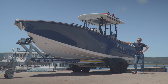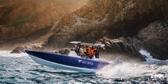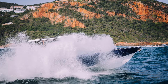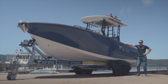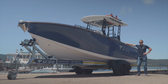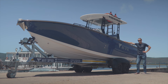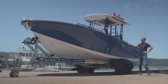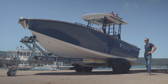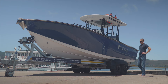This boat was designed from the ground up to suit South African conditions. We wanted the biggest boat you could feasibly tow on our roads. The South African Road Traffic Act limits you to a beam of 2.5 meters, because your trailer may not be wider than 2.5 meters. If you're wider than that you require a special permit. So with a 2.5 meter beam, traditional ratios restricted us to around 24 feet — which is where we ended up. 24 feet and a 2.5 meter beam, so you can tow this boat legally.